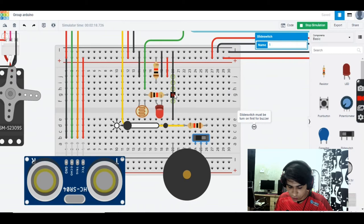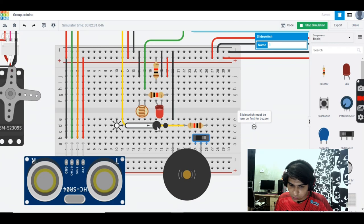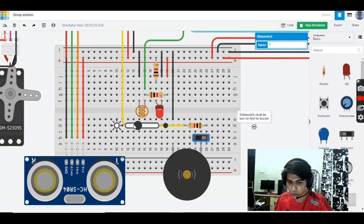Next, we're going to talk about how to limit the robot movement within the designated area, which is 90 by 90 cm as proposed by the competition guidelines. In this part, we use a photo resistor along with an LED, and the actuator is a piezoelectric buzzer. The photo resistor detects input from the light intensity of the surface of the tiles. As soon as it detects the border of the designated area — the dark black surface with an intensity of 650 and above — it will immediately ring. When the piezoelectric buzzer rings, it indicates that the robot is about to go out of the designated area, so we will know to go back as soon as possible.